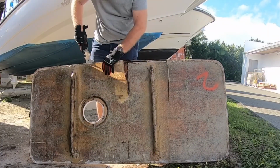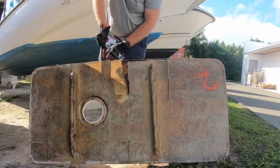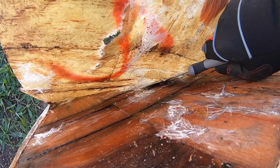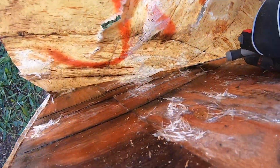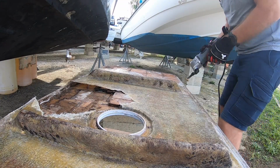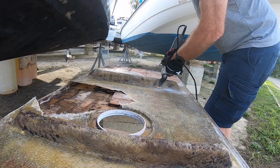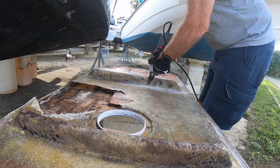So I tried prying the old fiberglass skin off the wet wood. Generally it came off easily enough, but did stick around the cross beams or ribs, not sure what you call them, and that meant a trip to the hardware store to find the cheapest multi-tool available in Bermuda, which still wasn't cheap. The new multi-tool made short work of cutting out the cross beams and removing the remaining fiberglass skin, which I think was probably just a single layer of chop strand matting.